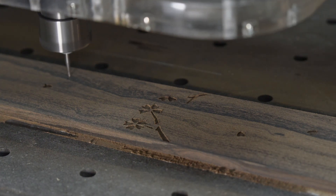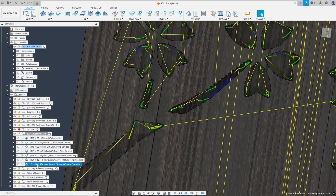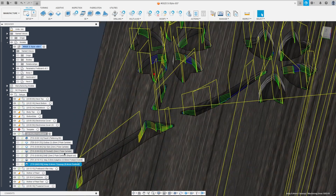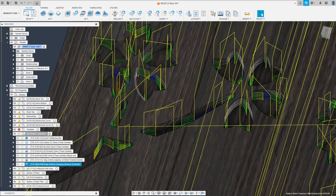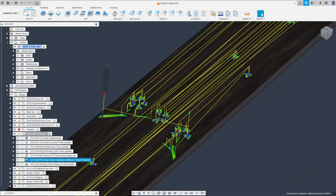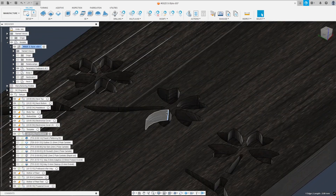Because I want quite sharp corners for some of these pieces so the design looks nice, I'm going back in with a 0.4 millimeter end mill just with a rest machining strategy to tackle all of these sharp corners and make the whole design look more crisp. At that point we have all of the inlay pockets cut — two millimeters deep in the fretboard, with about 0.2 millimeters of extra material remaining over top.